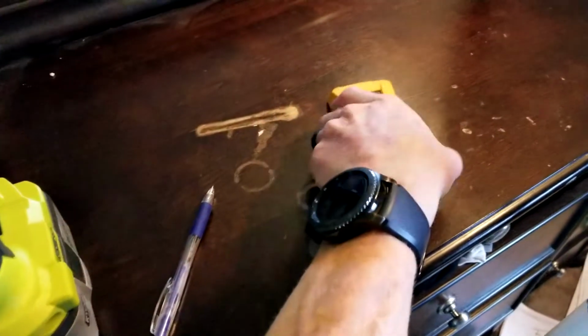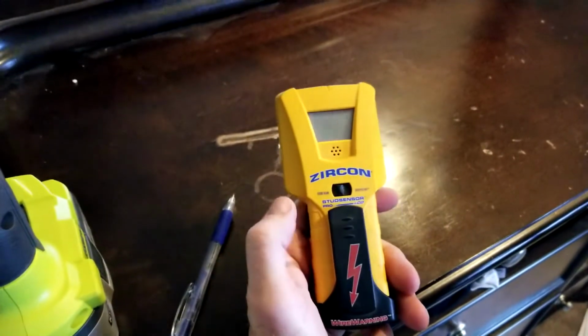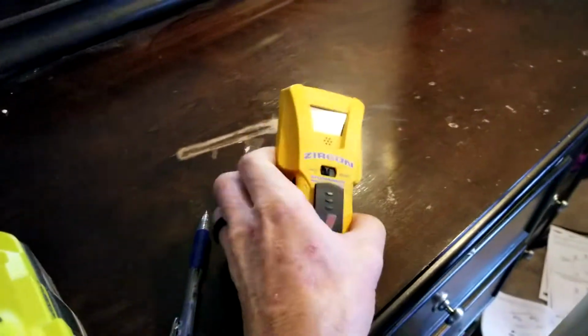All right, guys, again, a few tools we are going to be using. Stud finder, but magnets do work. And so what you do if you do not have a stud finder, trail some magnets slowly around the 16 to 24 inch range between studs. So once you find some drywall screws, the magnets will hook up. I've used this plenty of times. The first Mounting Dream TV mount, that's how I did it. This time with a stud finder, a lot easier with a stud finder.